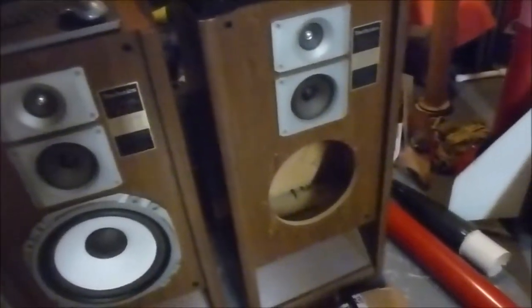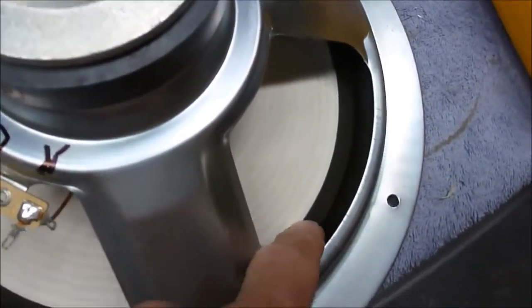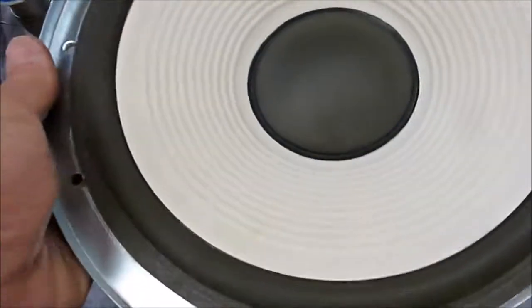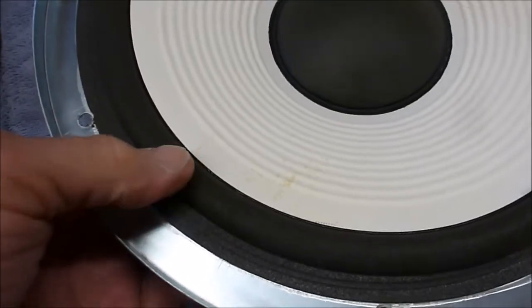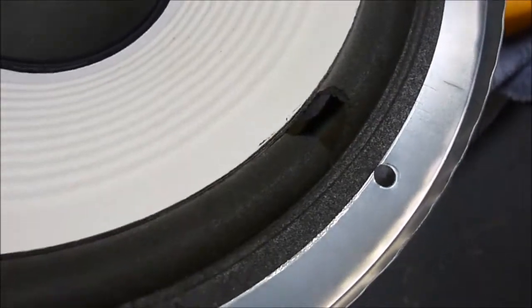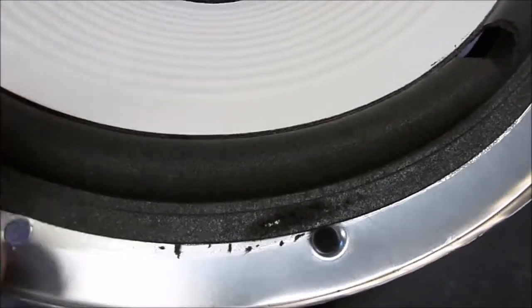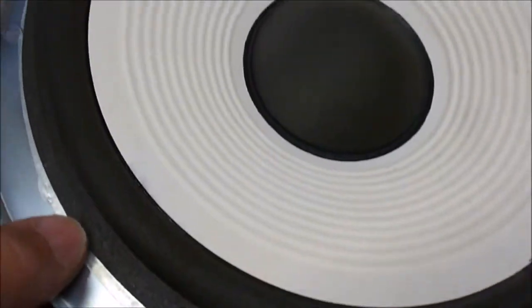So it looks like those Technics speakers were made in 1987. You can see on the woofer that the foam is attached to the back of this white cone to make a nice, neat line — that's a little bit more difficult to do but not too hard. This foam has got a crack there, you can see how it's starting to peel up. It wasn't terrible but it's definitely time to re-foam these. Again, the roll diameter and the foam itself are not standard, so we're going to have to custom fit a standard size.